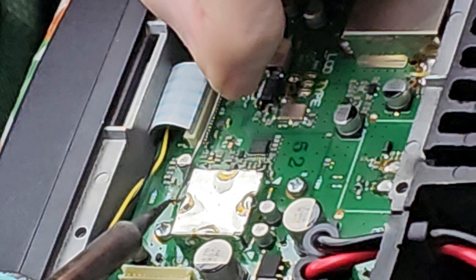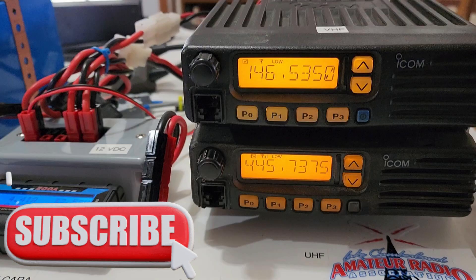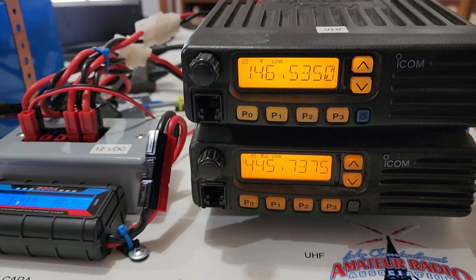This week on El Cara Ham Radio, we finally have the last couple of radios we needed to get CBR — that's cross-band repeater — number 7 up and running, so that we can have a spare kit out during the gravel route. We also found a setting in the programming that was preventing the CBRs from receiving for more than 30 seconds, known as a time-out timer. We'll have to fix that.